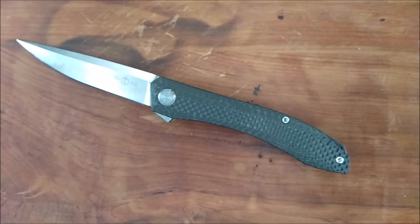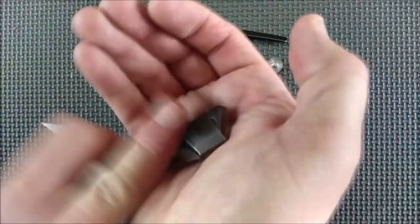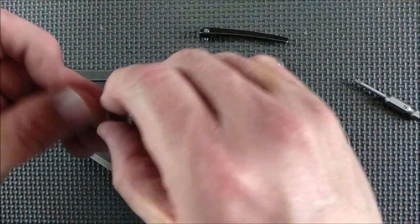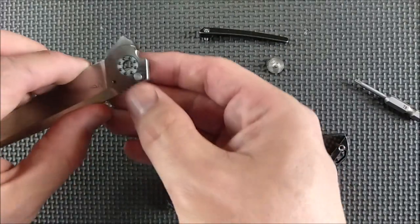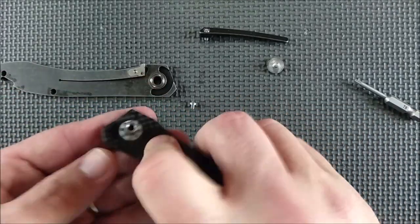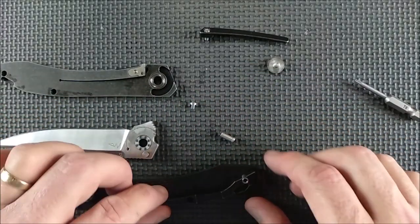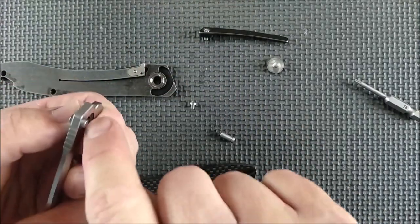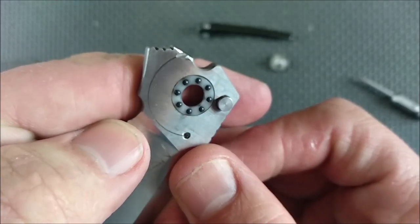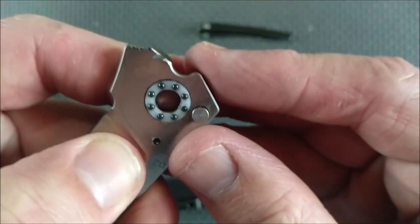Here's some video of the inside. Here's the knife taken apart. There's the lock bar insert — I'll give you a close-up. On the titanium side, there's a steel race, because titanium is fairly soft. The steel race lets the ceramic ball bearings run on it. There's another race on this side beneath the pivot as well — you can see it right there. So that gives it a long life. There's also a better look at the stop pin that's built into the blade. And the ceramic balls. There's a little ramp right there where the detent slides up on.